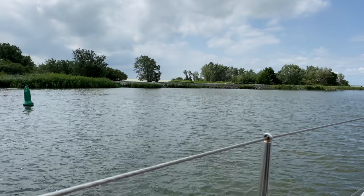I ran aground at full speed just to test it, like with 9 knots. And it slows the boat down in 12 meters to 3 knots, and then it gets stuck just where you are. We also ran it aground on those basalt blocks here, where you have those piers, those little dikes. That's like the hard concrete. With our first boat, we ran aground at just six, seven knots just to see what happened. And actually, we couldn't see anything. We saw a little dent on the steel centerboard, but because it's full of lead, it's so strong and so heavy. The boat is instantly sitting still. We couldn't see any cracks afterwards and did some dye penetration tests, but couldn't find anything. So it's pretty rock proof.